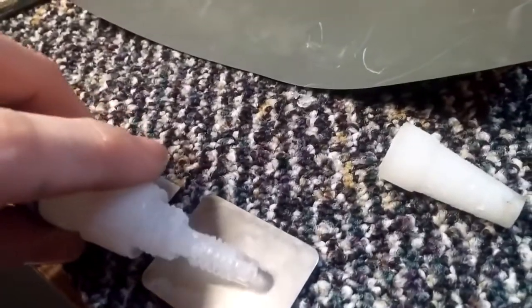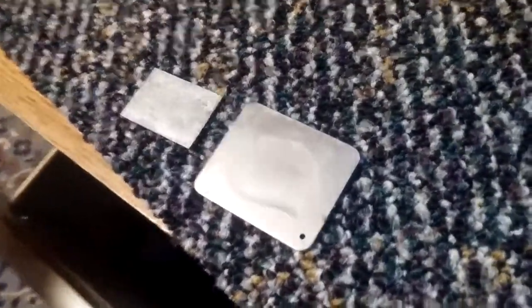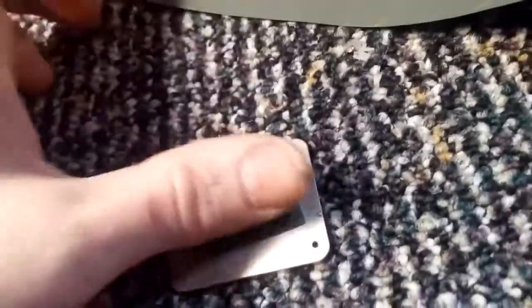Okay, so super glue. Remember, super glue reacts with water. It hardens, it cures when it makes contact with water or moisture. So, put the lid back on here. So what I always do is just lick this part, lick it. Then you get one chance to push it down, and well, there it's set. Can't move it now. That's permanent. Because the moisture in my saliva, it cured instantly. But there you go. That's perfect for sanding down now.